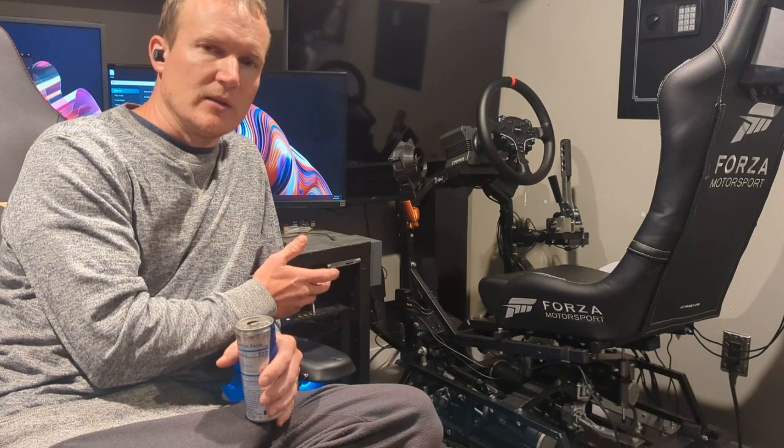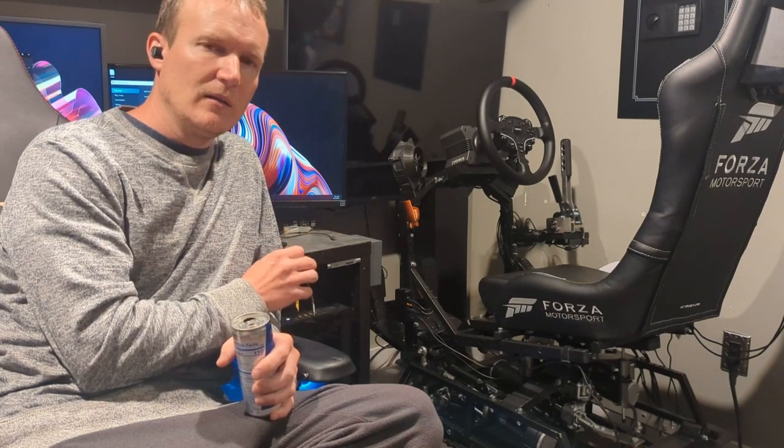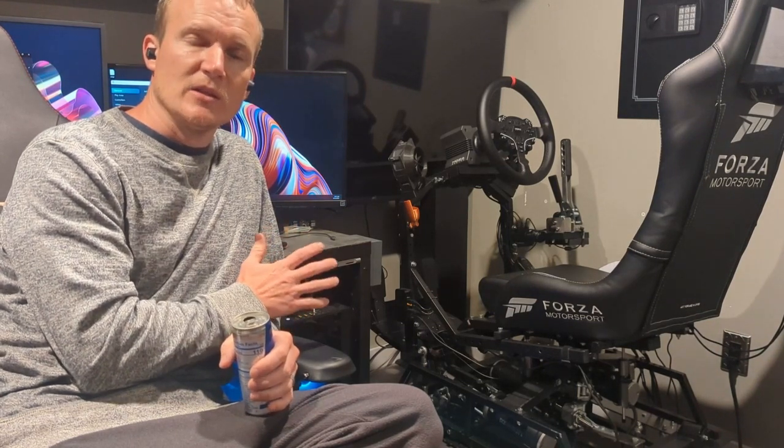So I'm left having to use a separate program to run the second DOF Reality controller, which is for the surge platform. And I ended up using Sim Tools because honestly, there just isn't a lot of options out there. The problem that I ran into was Sim Tools and Sim Racing Studio would conflict with each other. Once both of them were connected, one wouldn't work because it was conflicting with the other one. So I had a lot of troubleshooting to do with that, and it's not ideal now, but I do have a system that works. A little bit of a process I have to go through. It's not too bad, but things have to be done in a specific order, otherwise it just won't work. And I did a couple initial tests, and I was getting some really weird lag on the main platform.